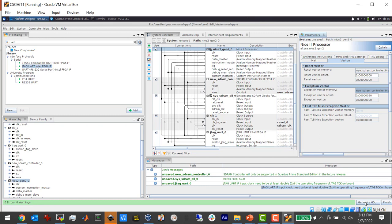I've now created a whole system: a CPU, a console, and an SDRAM controller. Eventually we'll add GPIO and other stuff, but for now we've got enough to run. There's 128 MB of SDRAM on here. You might ask why use SDRAM instead of on-chip memory — you could, but the FPGA only has about 64 KB on-chip, and I don't think that's enough to store the HAL/BSP, which is bigger than it ought to be. So we're using off-chip memory.